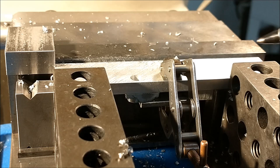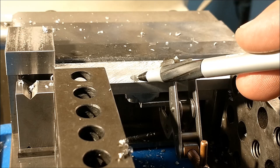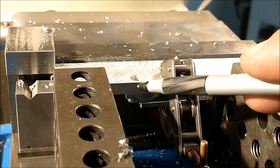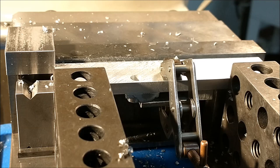This is a very reliable setup, the only danger is you are pushing the part away from the fixture, so be very delicate when you do this. Additionally, when you do this with a 2-flute or a 4-flute and there is a pilot hole already in there, the chances of forming a donut under the cutter at the break point between the plate and the part is also very possible. So that will increase the pressure. Be careful when you get to that break point not to do that and mess your setup.